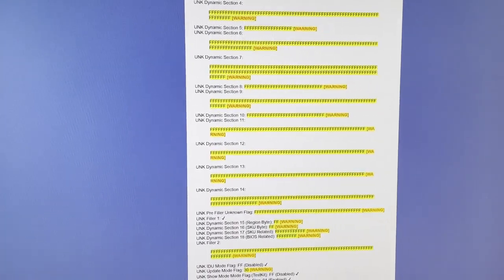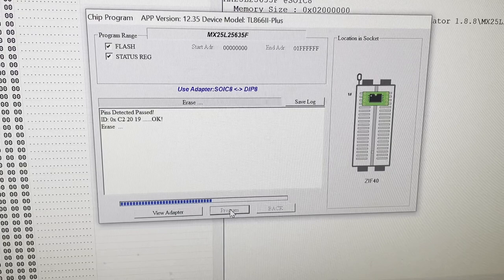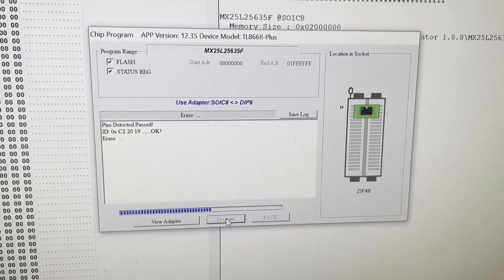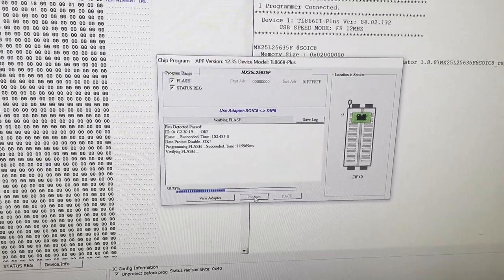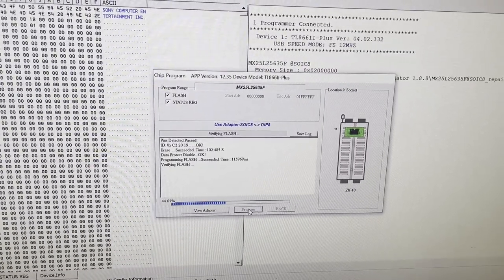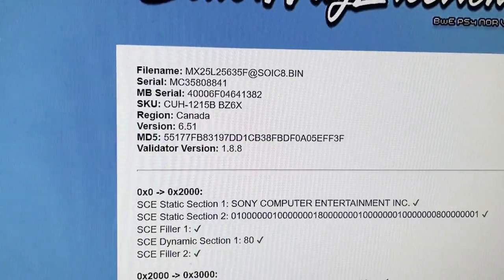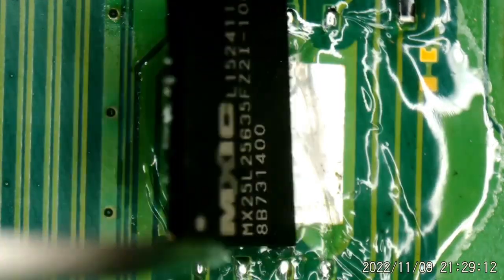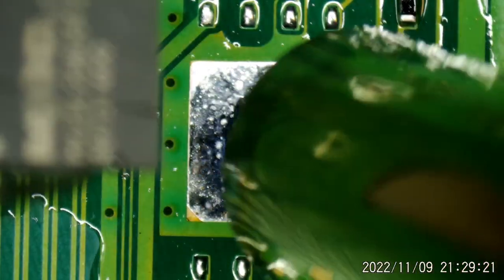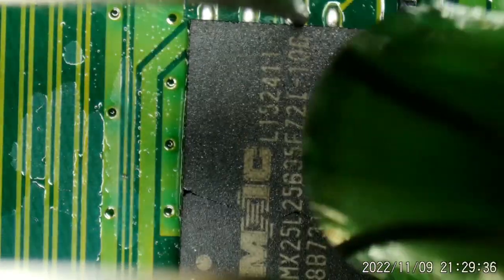I looked at that area — I don't have a lot of experience doing this, but I've messed with it before using a hex editor. I copied the section that was showing corruption — a bunch of FFs where there shouldn't have been, where there should have been zeros or some other values. I copied from another firmware I had stored; the corrupted firmware was version 6.51 and my donor firmware was 6.71 — close enough, I hope. I copied that section, rewrote it to the firmware, and reattached the IC. We are ready to test.